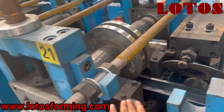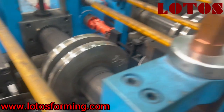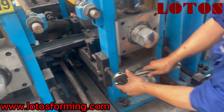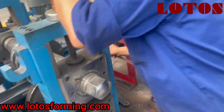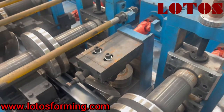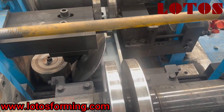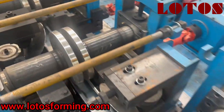This side roller here — this roller pushes the material to make the degree a little less, as you can see here. Just measuring, changing, and adjusting the position of this roller to move close to the center line. Each change we need to measure and make sure.